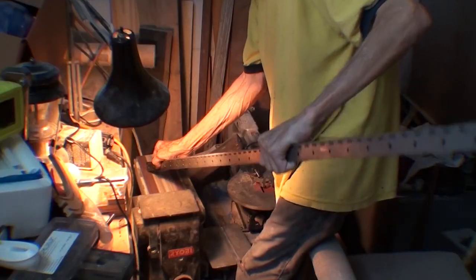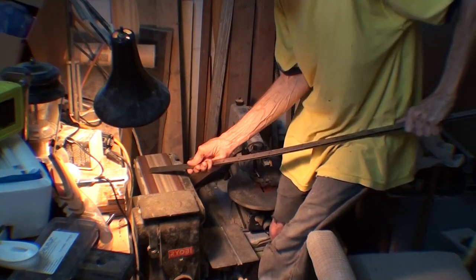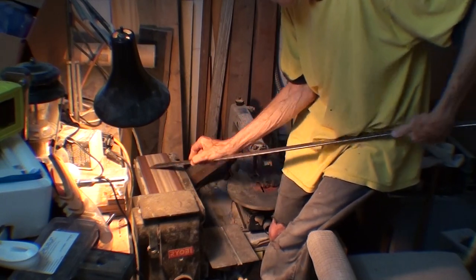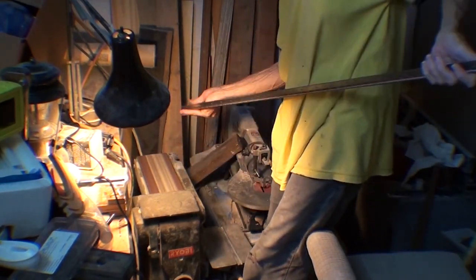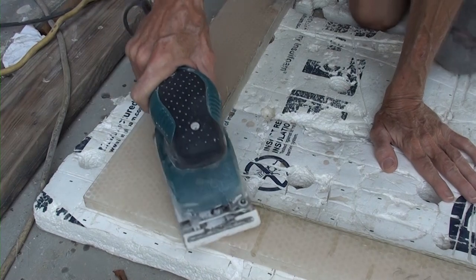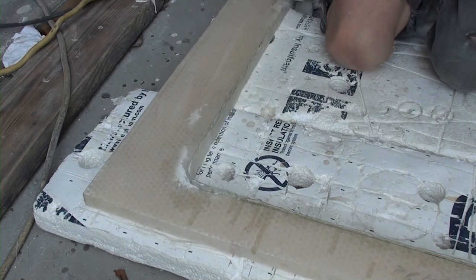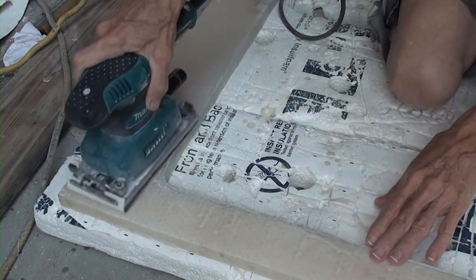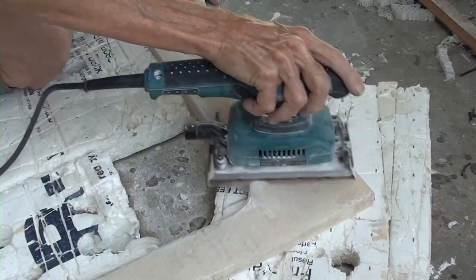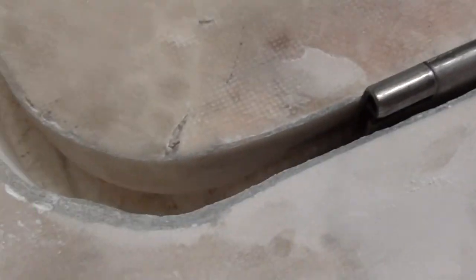And any time that you cut metal, or drill it, or do anything to it, you'll raise a burr. And so you have to sand that burr off so that the metal is smooth at the edges again. This is the fiberglass that I laid in to close the edges of the core. And if I keep the sander flat on the face of the panel, it'll sand that glass off just perfectly flush with the face. And finally, we can do a test fit with the hinge in place.